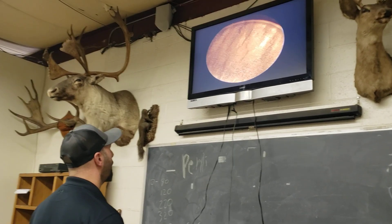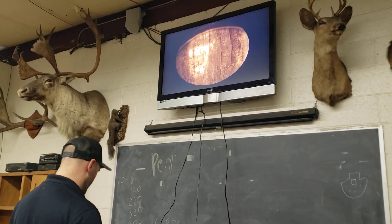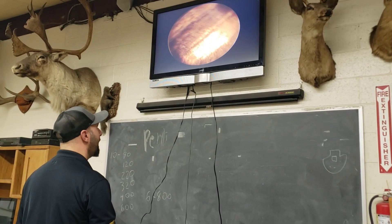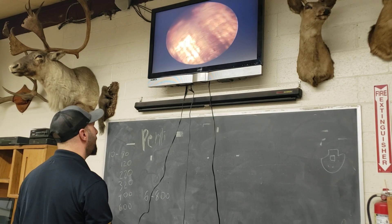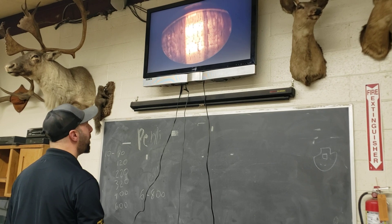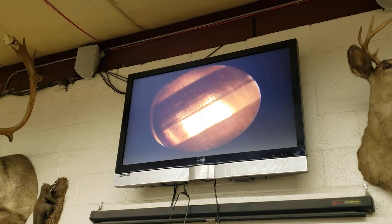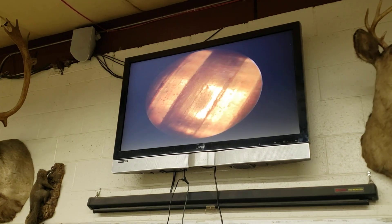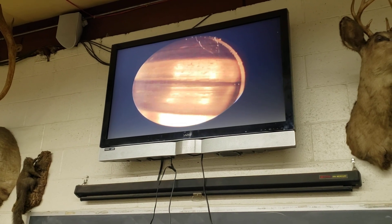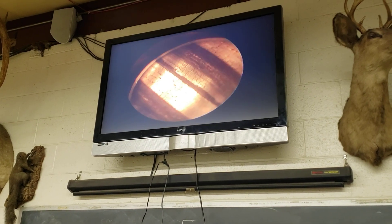It's changed color a little bit. It's got a lot of erosion and firecracking. You might actually be able to see it a little better now that it's clean, and the galling — this is the rifling. The beginning of that rifling is quite eroded. It definitely looks like the lands got polished where the copper deposits were. It definitely probably looks slicker than it did before, but this barrel is absolutely in bad condition, which makes it a really good example for the borescope.